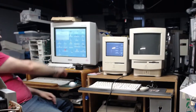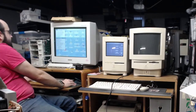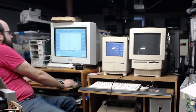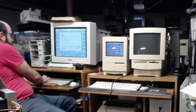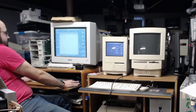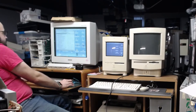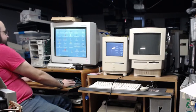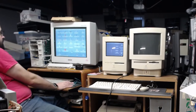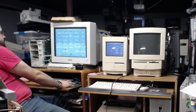So I'm switching the network connection back to AppleTalk over here. And going to Chooser. Going to connect to our Tiger machine. Going to connect to that volume. Going to copy over our speedometer application, which I should have on here, and now I do, so that's great. I'm going to open that with StuffIt Expander now that it's copied over to the network. Okay, that's an IMG file. That's just fine.